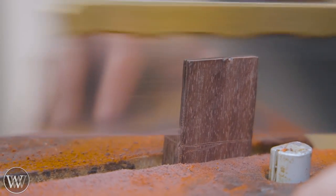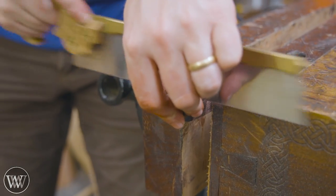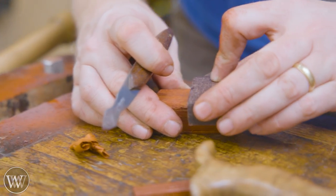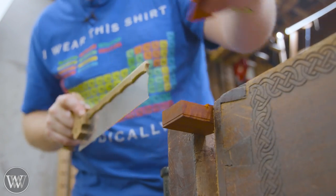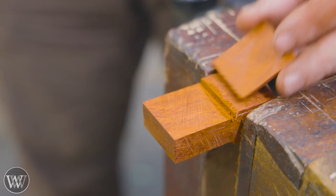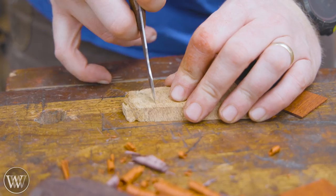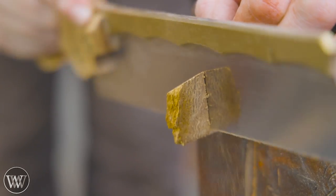These pieces are small enough that I'm actually re-sawing with a dovetail saw, which sounds a bit confusing, but that's what you need. It's a short rip and a dovetail saw works great for this. We're going to cut these all down to about the same size — starting with something about an inch and a half by an inch and a half, give or take. We want to make it bigger than it needs to be so that we have something to play with. For planing them all down, I love double-sided tape — you can put them all down on the surface with the side you've already planed flat and then plane them down while the tape holds them in place.